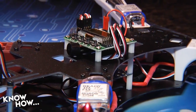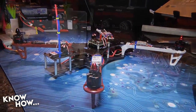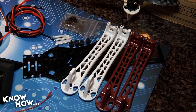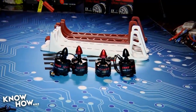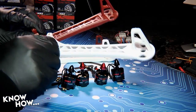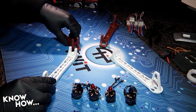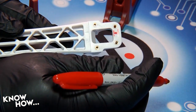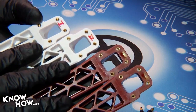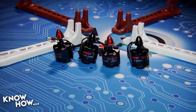The Alien X quadcopter is a good strong platform for building up your multi-rotor knowledge. Since the last 450-class build the prices of components have come down. In the 2018 Alien X build, the first step is to mount the motors on the arms. Your frame kit should include four arms in two different colors — decide which are forward and which are aft, since you need to easily see orientation once airborne. Mark your arms one through four: one is forward-left, two is forward-right, three is aft-right, four is aft-left.